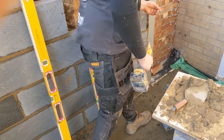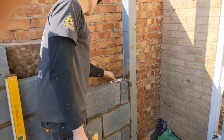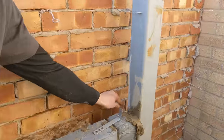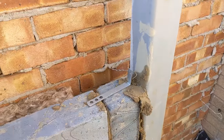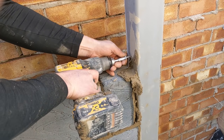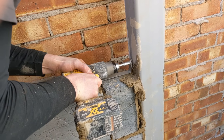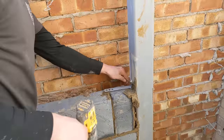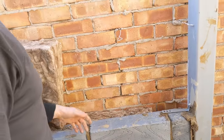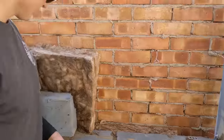So this is how we're fixing our block work to this steel. We're using these ties, and you see how I put the tie wires tight up to that steel as well? So I'm going to put that up to there. This is like a little self-tapping screw — I could do with an impact driver but I've not got one. There we go. Now the tie's tied to it, and this is tied to it. Then all I'll do is just lay my bed out, put the block on that, and tie to this — so it's all solid.